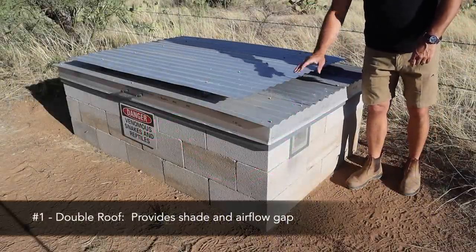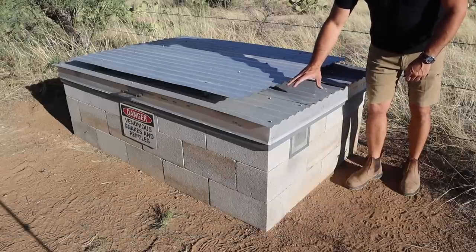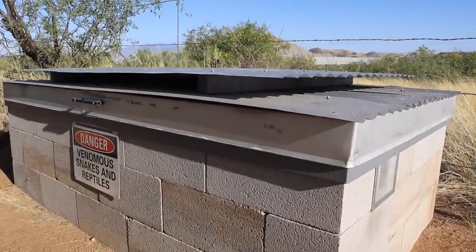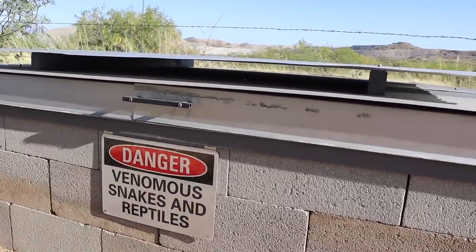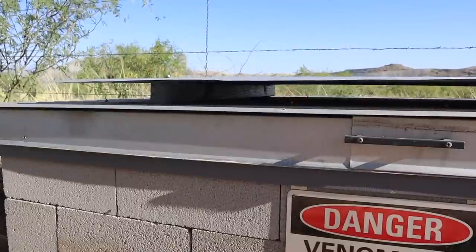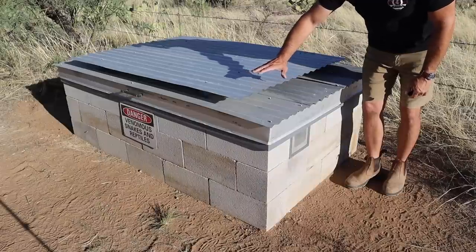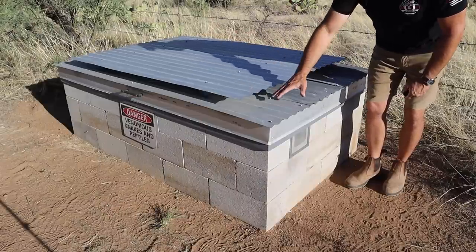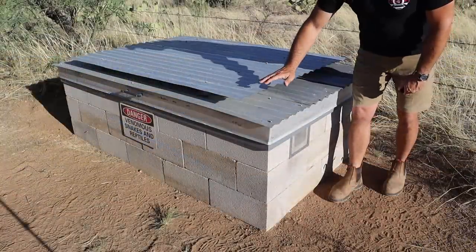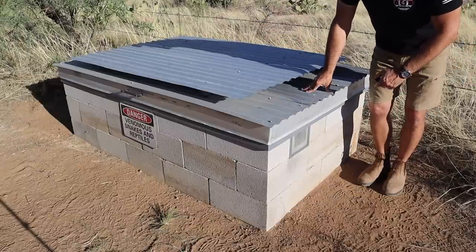One of the most common questions you guys asked had to do with the metal roofing and whether it was going to get so hot with the sun beating down on it that it would heat everything up inside, kind of creating like an oven. My solution was to create a false roof — it's raised up about three inches above the original roof. I just added a couple boards and laid some extra scrap roofing on top so it creates almost like a thermal space inside where it shades the roof below. The roofing on top covers about 75% of the length, and if you place your hand underneath the shaded side, it's probably a 30-degree difference from the surface temperature versus the shaded side underneath. It's nothing real scientific, just a little bit of common sense.